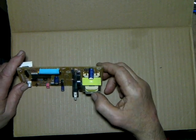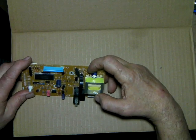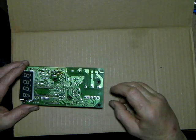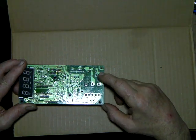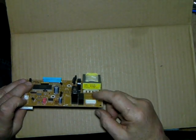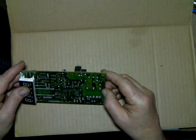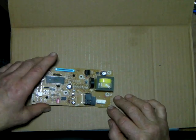Even the transformer could be used if you needed a keying circuit voltage, because most of these are a center tap — there are two diodes there. I think that's a 25-volt cap, so this is probably a 16 or 12-volt transformer. The heavy lines on the back are your 110 input, and you'll see it runs over to a plug that goes up to the power cord and the fuse. Real simple little transformer with six pins, unsolder real easy. That will give you a nice screen relay and another keying relay if you need it.